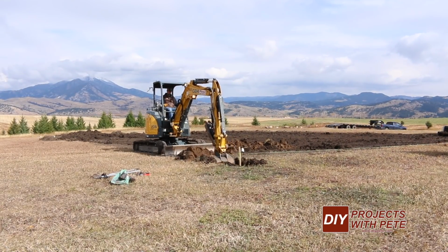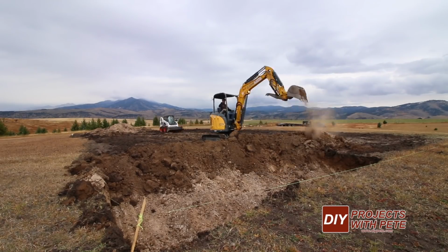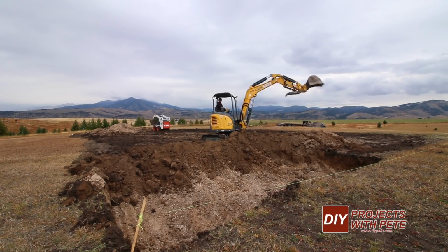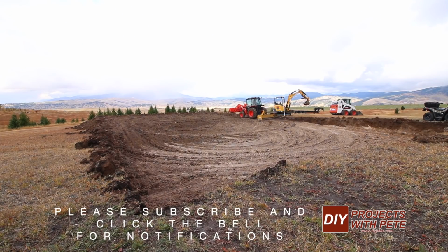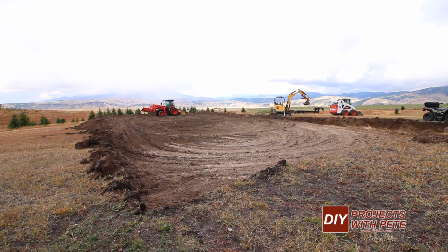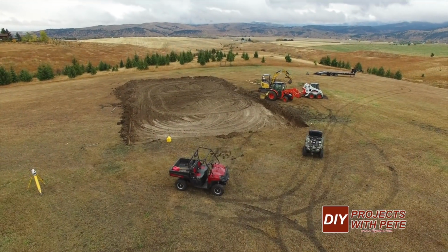If you're interested in seeing the leveling process I went through, you can check out that video, which is linked in the description. I rented a mini excavator, and my buddy Josh brought over a bobcat to help level my 6-foot slope. I took 3 feet out of the high side and built the low side up 3 feet with the fill to get a nice level surface. A tractor with a box blade was used toward the end for smoothing things out before I could move on to the actual rink building process.